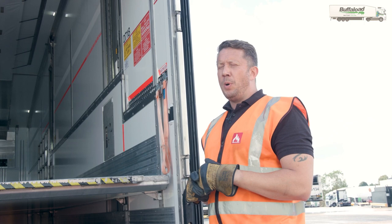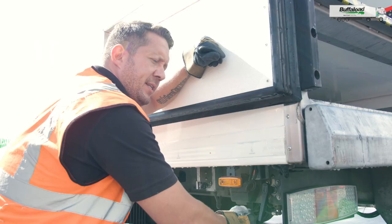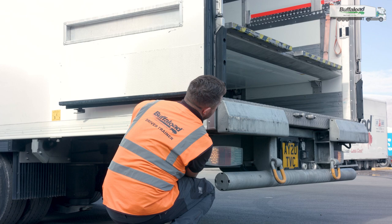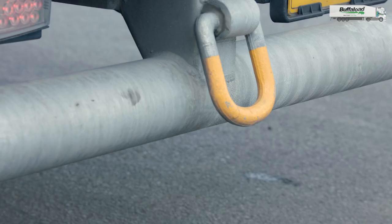You're going to have to be mindful of the height of the trailer at this point. You may need to lower the suspension so that the bed is in line with the bay, and the way you do that is by operating the handle on the outside. Here we have the blue handle. You should depress the handle and then turn it to the left and that will lower the suspension of the trailer. As you can see, the trailer is lowering. I'm just looking to make sure the level of the bed is in keeping with the level of the bay. Once you're content that you've got it correct, simply let go of the handle and the trailer will stay in that position.